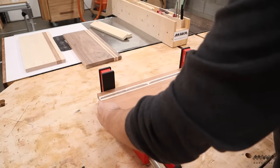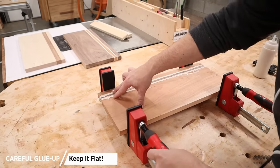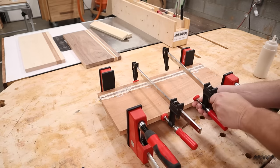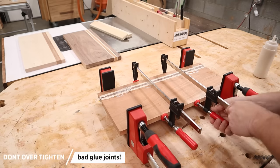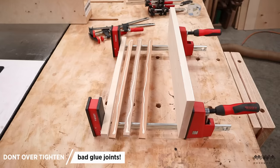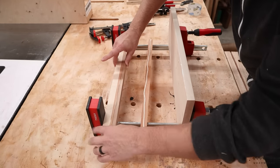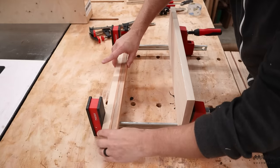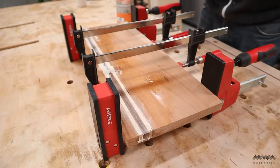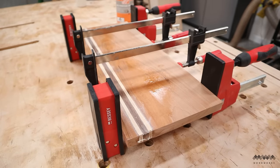Once I get all my pieces glued up, I begin adding the clamps slowly. Things are going to want to slide around and I don't want that. Since I'm using minimal tools, I want to take care to glue this up slowly and keep an eye on those strips to make sure everything stays flat. You really don't want to crank down on the workpiece — three small flexible strips shouldn't need a lot of force. If you're getting a nice line of squeeze-out along each joint, you have enough pressure. Cranking too hard can starve the joints of glue, possibly lead to failure, and introduce tensions that could cause warping.